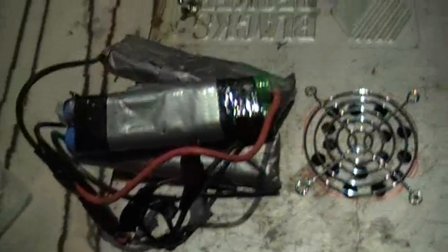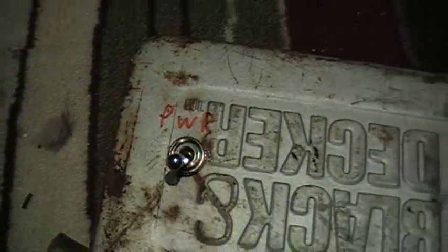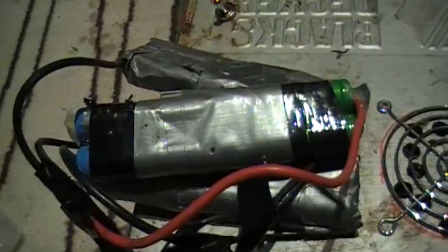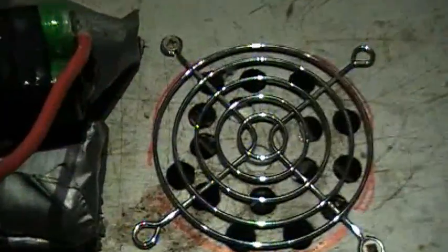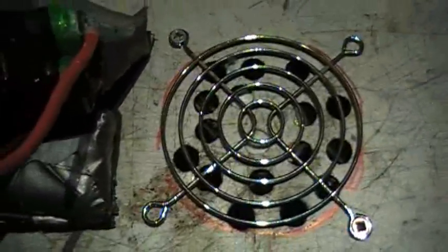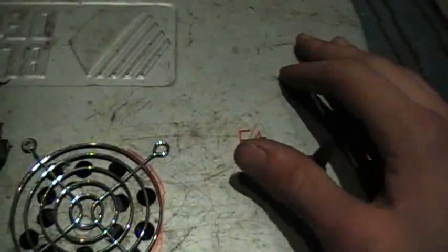First test of the new discharge box. I put a power switch in that corner. I've only set up one switch — it's a five amp discharge. Got the plugs all in. Just using some cheesy batteries. I also added a fan so it could cool down the light bulbs. Flex the power switch — fan comes on. Hit the five amp switch.